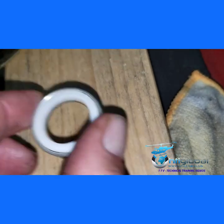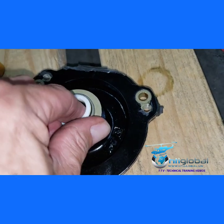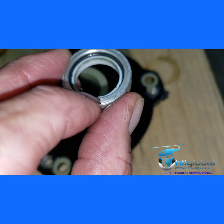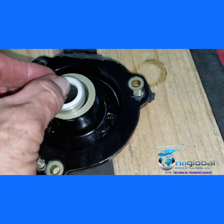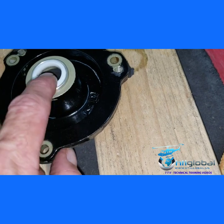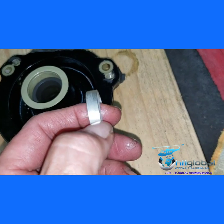Whenever you're going to install this excluder — if you install it the wrong way and put the retainer on, you're not holding much of anything and the Teflon can come off. Notice how easily it can come off. So when doing this, make sure the outboard side has the aluminum shoulder facing out. The retainer will then keep everything inside in place. Remember: the shoulder of the housing goes out, and that's where the retainer keeps everything in place. The pro-seal goes right here to seal all of this.